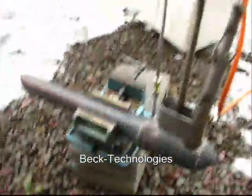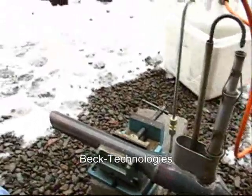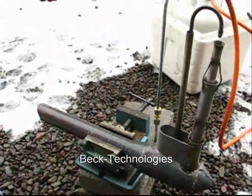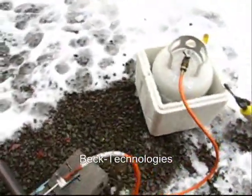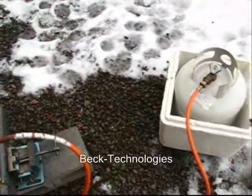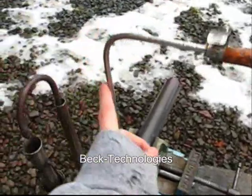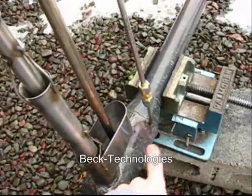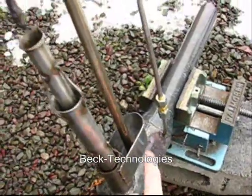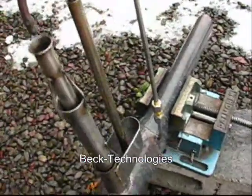This is a small pressure jet engine. Pressure jets are basically a type of valveless pulse jet. The way they work is you have your propane tank here, which provides high pressure propane, and then that goes to a fuel injector line. That injector line goes into the engine, has several coils, and then goes up to this primary injector tube.